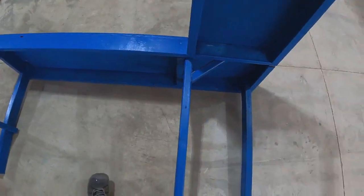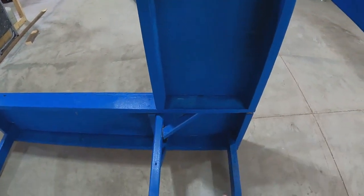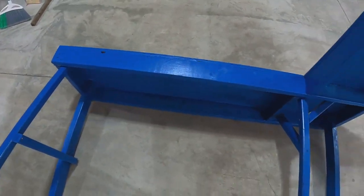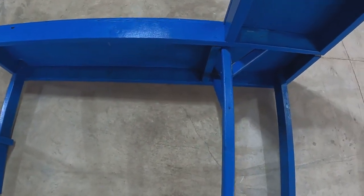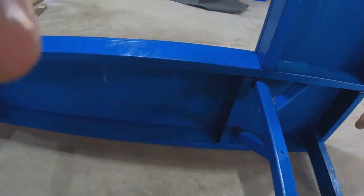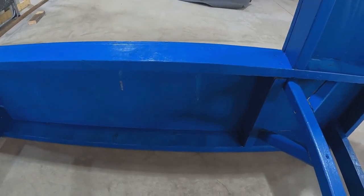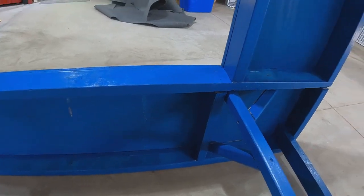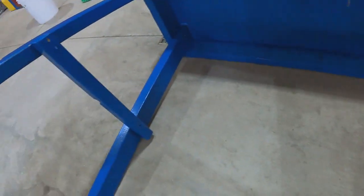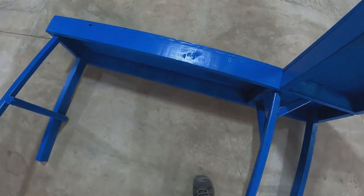Now, once again, I had some extra wood left over. So it's 2 feet wide. And there's a 4-foot line here for setting your rifle on. And then there's a 4-foot from there to there that if you want to have things next to you when you're scoping in your rifle. Also, I ran 2x4 all the way across, two of them there, and screwed everything down to it so it had a nice strong support. And then I did a leg up here, and you can see there's five legs because of the center one I added for a little bit of extra support.